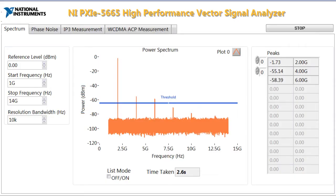What you're seeing on your screen here is a 14 GHz spectrum, starting off at 1 GHz with a resolution bandwidth of 10 kHz. The 14 GHz spectrum is really useful when you're doing harmonic testing, radar testing in the X or KU band, satellite testing, radio testing, and EMI testing as well.